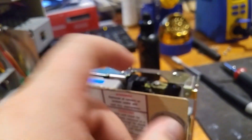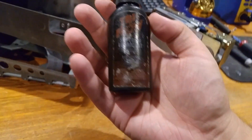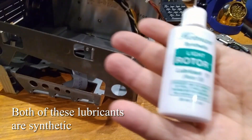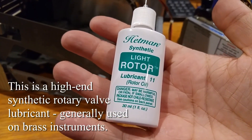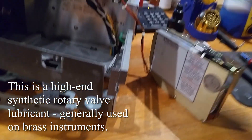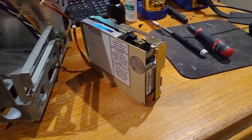Here's the motor — I think that is the detector for position potentially. The idea is you lubricate that up with some lubricant. Now I'm not sure this is the stuff that he used — Tri-Flow, a bicycle lubricant. This one's very old, at least 15 years old. I couldn't find that, so I'm going to use this Hetman rotor oil, their lubricant 11. It's similarly thin, probably good for something similar, plus it already has the applicator built on. I thought I'd use this since it's readily available.